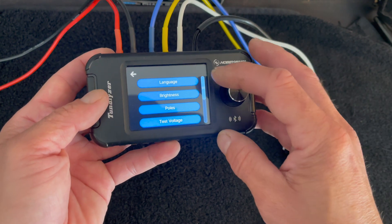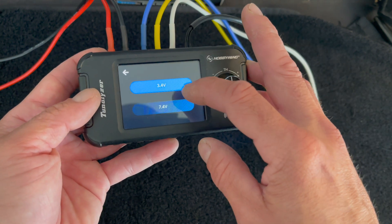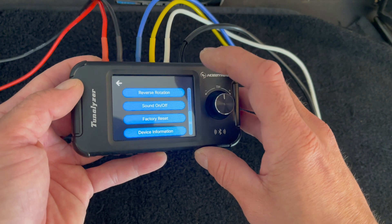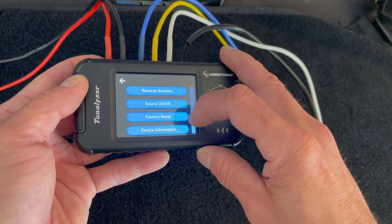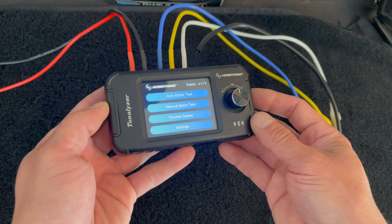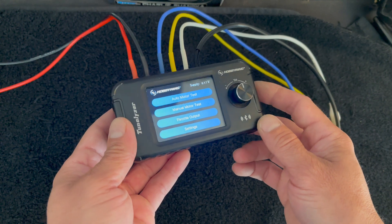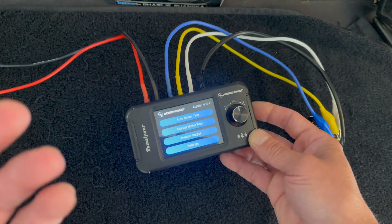In the settings you can control the poles if you already have it powered up, so you don't have to cycle it on and off. You can set the test voltage to one cell or two cell — I do most of my benchtop stuff at one cell voltage. Scrolling down you get reverse rotation, so if you want to check motors backwards for opposite rotation transmissions, drift, rock crawlers, things like that. You can also turn the beeping on and off, reset any of your settings, and get updates. As mentioned, this will work as a Bluetooth module for your XeRun series of speed controls or any speed controls that work with the Hobbywing app or the OTA or the LCD programming box — though not for the Quick Run or more basic lineups, only for the XeRun series, Max series, Platinum stuff like that.